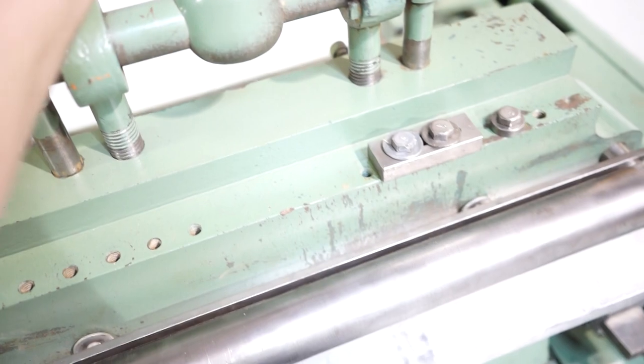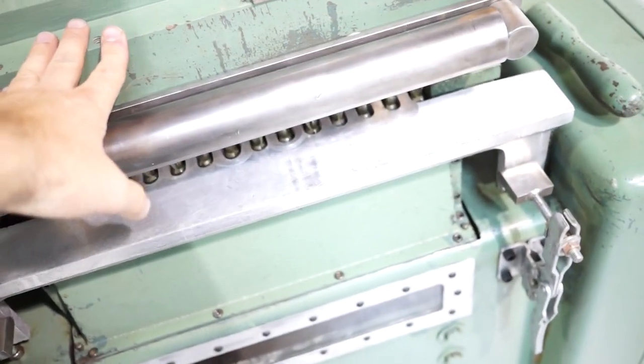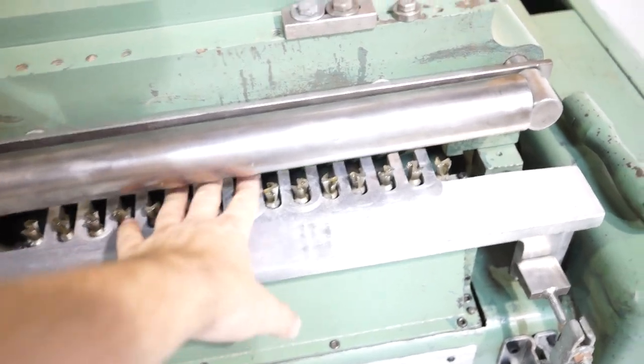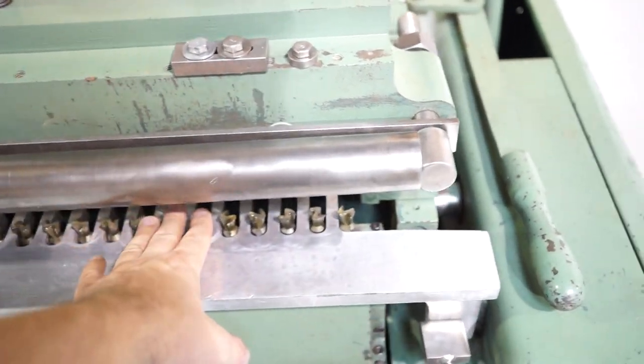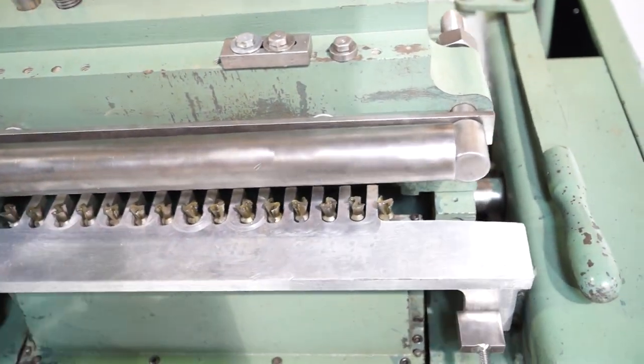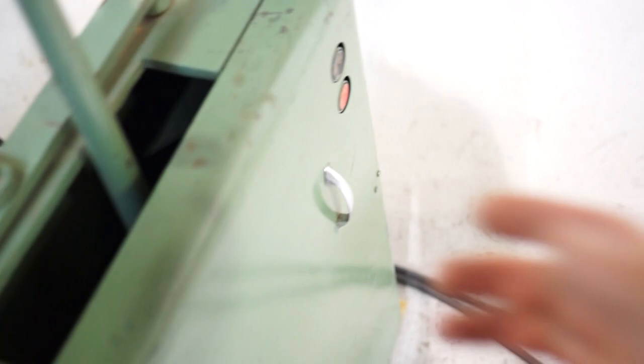It's a really simple machine to use. What's really nice is you are cutting the males and females with the same bits. That's what's nice about having a multiple-spindle machine — your dovetails fit together evenly. We're going to turn it on real fast.